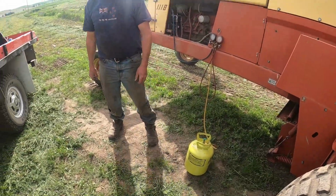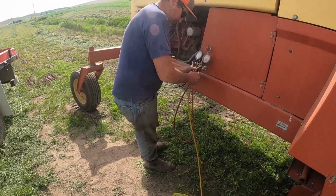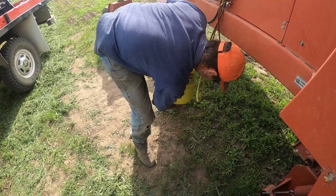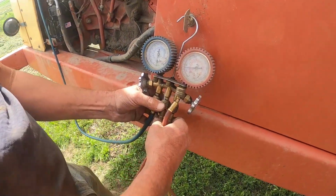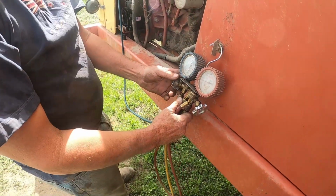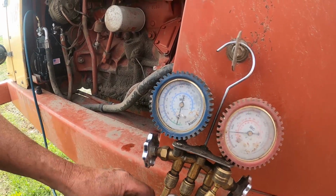This is gonna go against conventional wisdom here. Oh, it is? Because most AC types you do standing up, not inverted. Okay. But this is a different kind. We're all vacuumed down. System is holding. Now we're gonna try and fill it with the liquid freon. We just did that to make sure that all of the oxygen is out of the line. Once you saw the white stuff coming out, that's the freon. So it's full of freon now, not oxygen. We're going to open up that valve, and that's going to put it into the low pressure side. Compressor. Low pressure side, yeah.